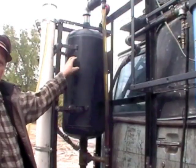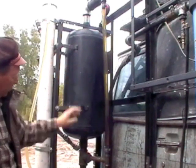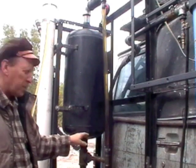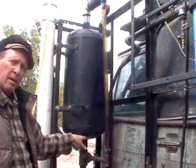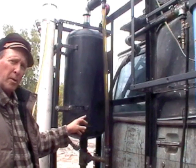This is a closer view of the 20-gallon waste oil processing tank that I use. You'll notice that it has a bell-shaped bottom. That bell-shaped bottom helps to concentrate the sludge that precipitates out of every batch of waste oil that I process.